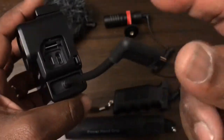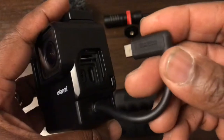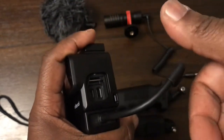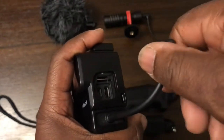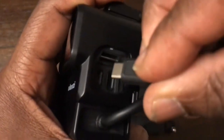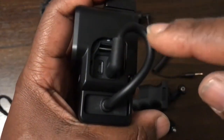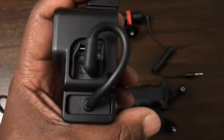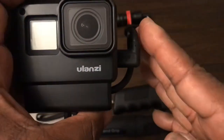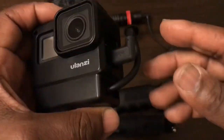Now, to connect this to the camera — do not connect it straight on like that because you'll eventually damage the wire. What you want to do is hold the frame here and do a twist motion — twist it back on itself, and as you're doing that, place it into the socket. You should have a swan-neck configuration at the side, running flush and parallel with the camera body. This keeps it compact and will not damage the wire.